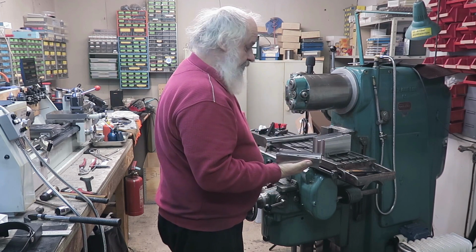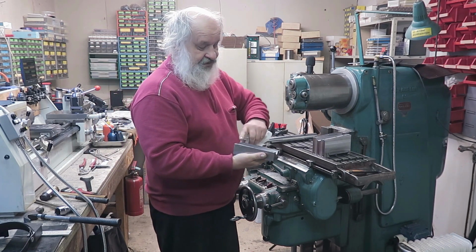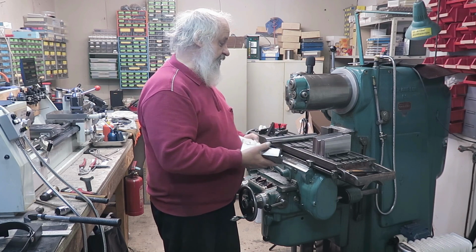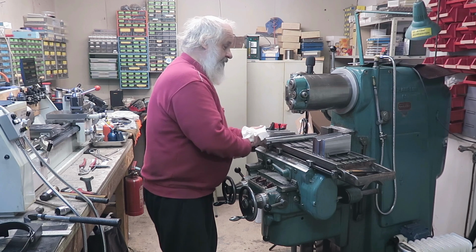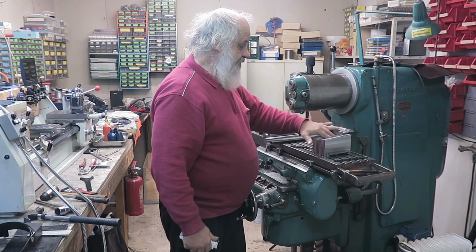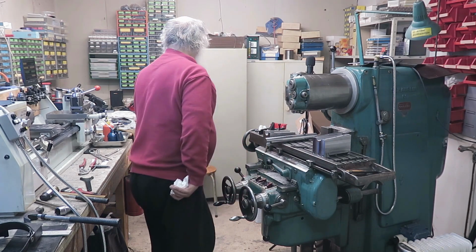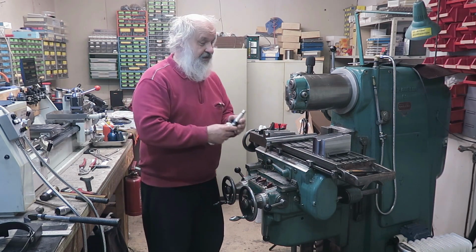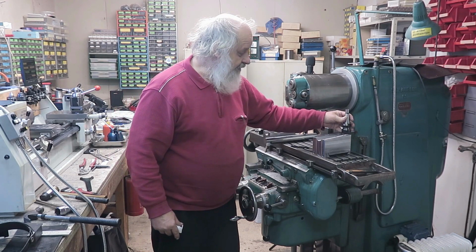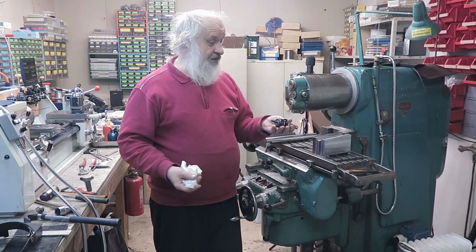Yeah. So what I have done here already, I stoned these edges. These are super sharp when I first took it out. These were really bad. And now it's there. So now we can mill it. No trouble at all. It's like putting your end mill into here and milling it. And I think we have enough room here as well. Yes, we do. So now it's child's play.